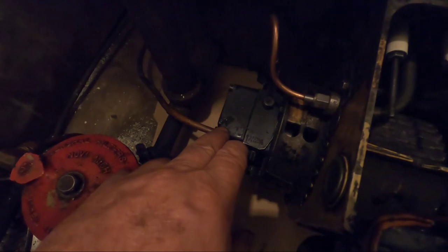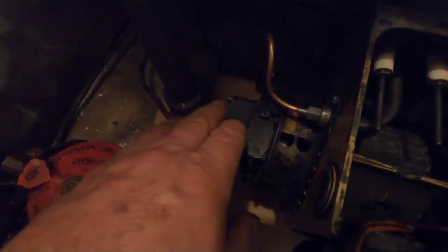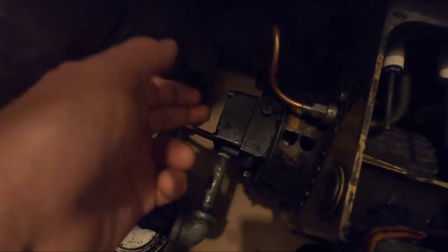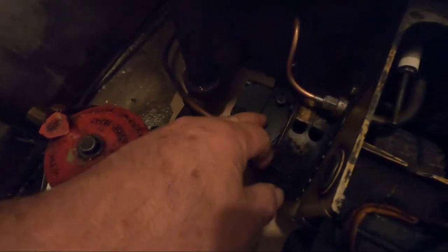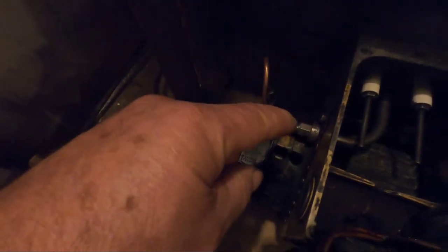This is a Suntec, and at the supply house, they said this is the common pump that they sell all the time. And I have to tell you, this pump's a lot quieter. This pump also has a strainer in it. The pump I pulled out doesn't have a strainer. Well, they call it a strainer, but it's actually blades that cut up any debris that bypasses the filter and comes into the pump. I think that's why that pump was so noisy. But that's the pump we're going to pull apart.